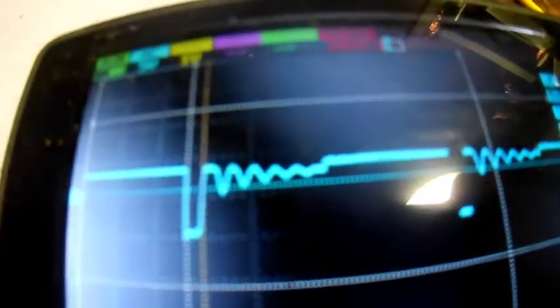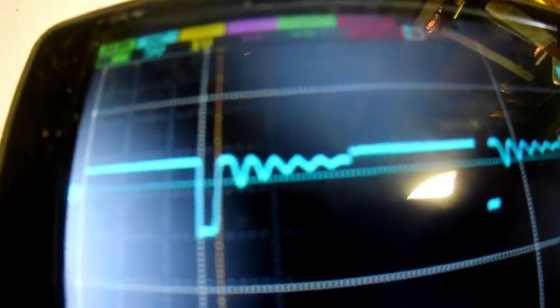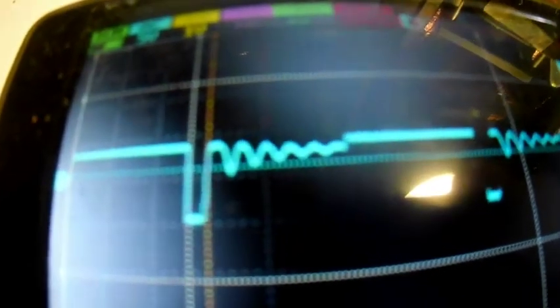I want to get rid of that oscillation. I'm not sure why it's got that spike in there still — I'm going to have to fiddle with the circuit some more. Maybe it just can't supply enough current from the battery. I'm using a battery source to drive this, and I might have to incorporate this resistor into this design so that I can damp out that ringing.